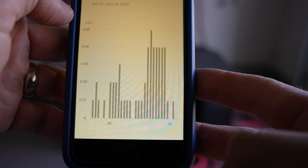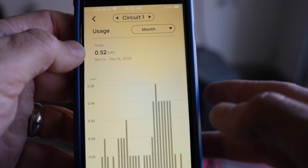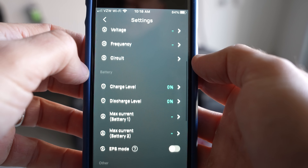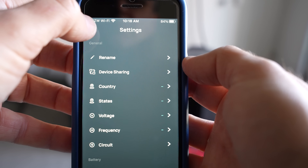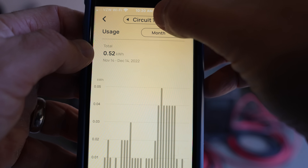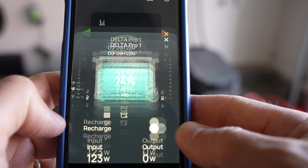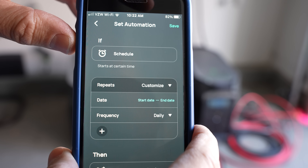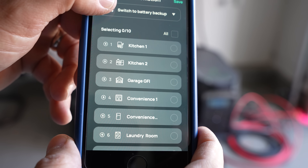This is commonly referred to as power arbitrage. And just to be clear, this setup does not send power directly to the grid, but rather to the 10 lines that you connect in your house. The app can be connected to the internet to allow you to monitor all of this remotely. As shown here, we can set up 10 lines in our house and see their daily usage, which is a powerful tool to monitor usage in your home. We can see the status of the battery, charging input, and percentage charge. You can define the depth of discharge on the battery, program it to automatically start up the dual fuel generators when batteries are too low, schedule automations instructing when to charge and discharge from solar, generators, or the grid, and define the priority of the lines to be powered.